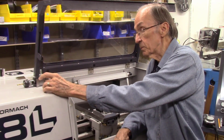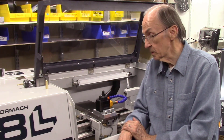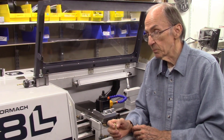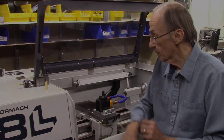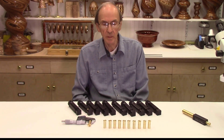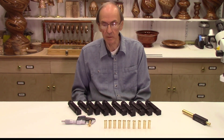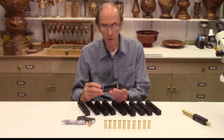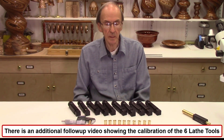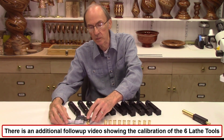But doing that, it actually worked quite nicely. It wouldn't be worth doing for one or two pieces, but for doing a hundred like I do, it worked out quite nicely. This is a nice machine for doing the small parts and pieces that I do. I do a lot of small parts like this and this is the precise size of machine that I need. This concludes this video of the production of these brass index bearings for the AccuSlide system. I machined about a hundred of these brass bearings and assembled about 30 or 40 of these indexing systems. The Tormac lathe worked quite nicely — I was quite happy with the precision. I got better than two tenths of a thousandth variation in the parts that I machined.